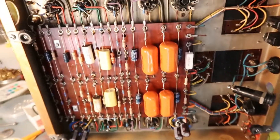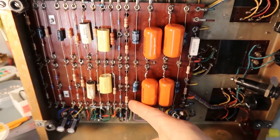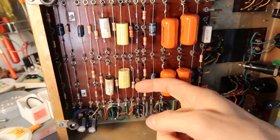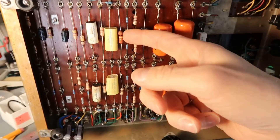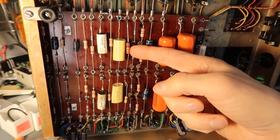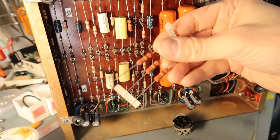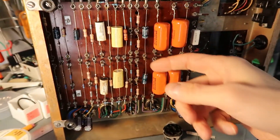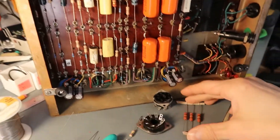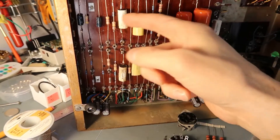This thing has already been reworked — I can tell there's a bunch of cheap 5%, 1-watt resistors here, probably from Radio Shack. I'm going to go through and upgrade those to low-noise metal film resistors like the one I've already stuck in there. It's 5% also unfortunately, but I already checked these to make sure they were within a percent, so we're good. These are much, much better resistors, so I'm going to replace the rest of the 100k's.